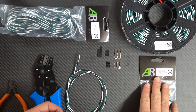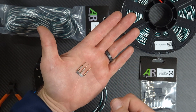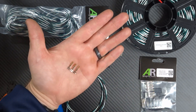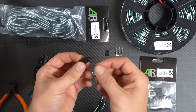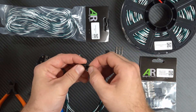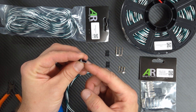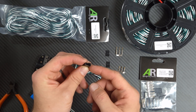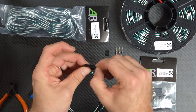A really cool thing about the AR crimps is twofold. One, the crimps are actually gold plated — you can see that they're gold plated on both the male and the female ends. And two, if you look at the sleeves, these have got two cool features. Firstly, they've got the safety lock here which, when you connect these up, will actually hold it in place. And also, it's both JR and Futaba compatible. So you can plug a Futaba servo in there because it's got the notch, or you can plug a JR standard style servo lead in there, and it'll accept both. The lock will still work for both connectors as well.